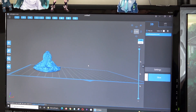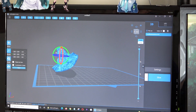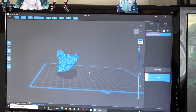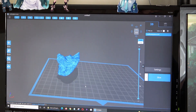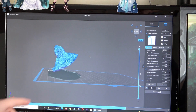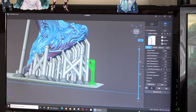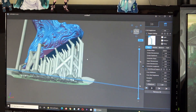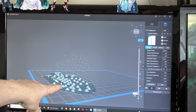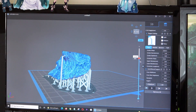So what I'm going to do is actually tilt these so that it prints them in smaller slices. If I click on rotate and tilt this up on its edge, that way it'll print smaller areas at a time and that will just generally be more efficient. I don't really need to tilt it any more than that, so I'm going to print it in that position and just add supports. If I click that button there it'll place a raft beneath it, and then if I click 'all' it'll add all of these little scaffolding supports. If I slice that, you'll see it'll start at the bottom with the raft and then layer at a time it'll print all the supports first and then slowly start printing the actual item until it goes all the way to the top.